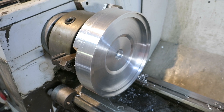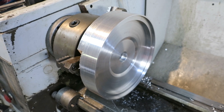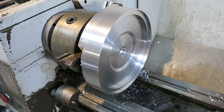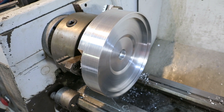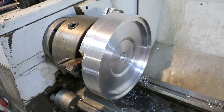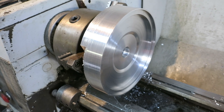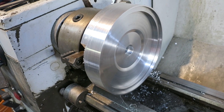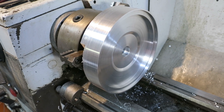That's the first side of the flywheel all turned up. It's made out of 6061 T6, 2.5 inch thick plate — I just bandsaw cut it out of a rectangular plate of aluminum. I turned it in one shot, so everything's going to be concentric on this side. Now I just got to get the other side concentric as well.